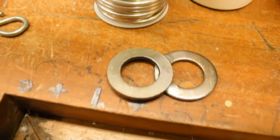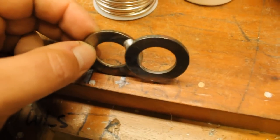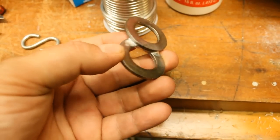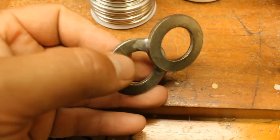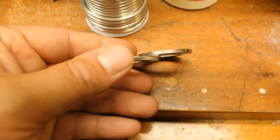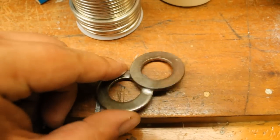Somebody on Homebrew Talk threw down a challenge, basically, that he doesn't believe silver solder works on stainless, because stainless is so resistant to tarnish that the solder doesn't actually wet the stainless. It definitely happens more with softer metals like copper, where even if you desolder, you can see the solder remains embedded in the metal even when you start sanding it. I don't know if it happens as readily with stainless, but I can tell you it's good for a pretty strong mechanical bond.